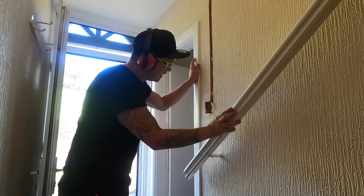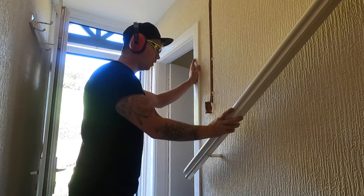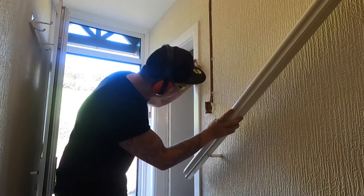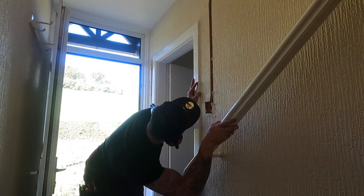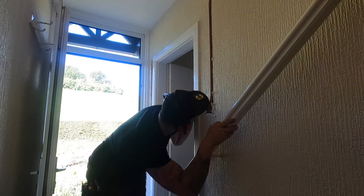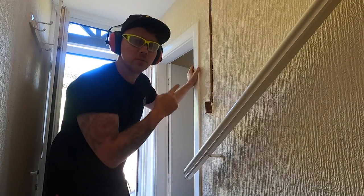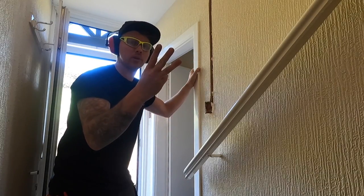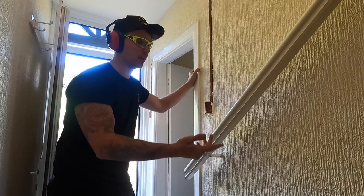With the floorboard we got yesterday and where the cables come down - the light switch drop in the hall - can you pull them up for me please mate? There should be a singles and two two-cores. Also worth mentioning: all these switch drops that we're going to do, we're going to do in three-core, so that will allow us a neutral at the switches for the future in case any smart switches go in.